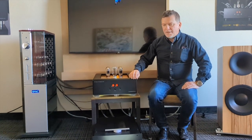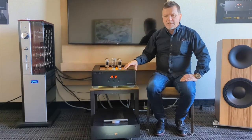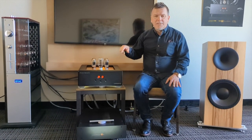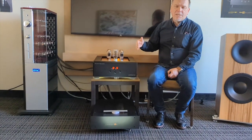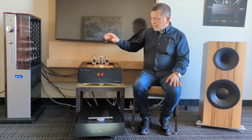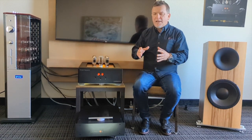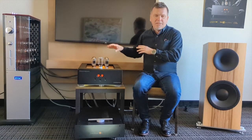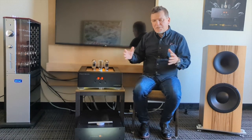So we started by abandoning steel altogether and abandoning all the metal bending, so it's all CNC. We started using big slabs of aluminum and then designing all the cutting and polishing and CNC routing and creating new surfaces. And it required changing the design from a single piece design to a total design. So you design all the elements, including electronics, tubes, screws, everything, in one file in AutoCAD, and then you can put it together, and then you can blow up, expand your drawing, and then concentrate on aluminum, concentrate on PCBs, transformers, cables, sockets. Everything is in one design. So when it comes together, it fits.